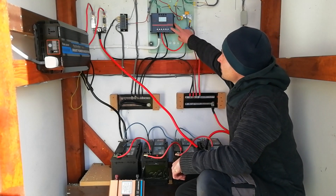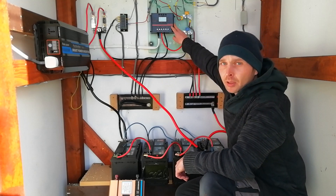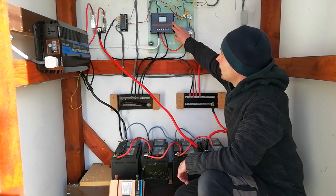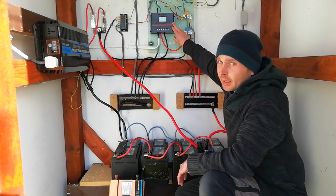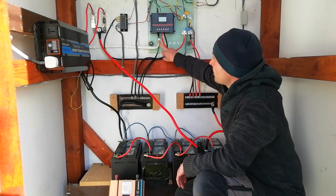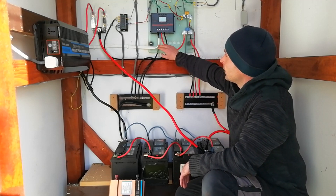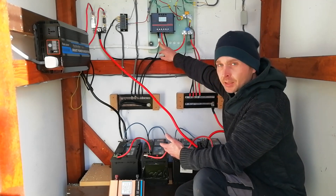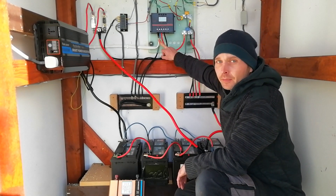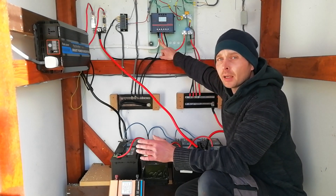Next up, control units. This solar control unit here is able to handle 80 amps coming in from the solar panels — we'll go over and have a look at the panels in a minute. So anything above 80 amps and it's not going to handle it. This is the wiring coming in from the panels. They're really easy to set up — there are only six connections: positive and negative for your battery, because it's a DC system — we're not at the inverter yet. Nice juicy wiring to handle the current coming in from your panels is really what you have to keep an eye on.